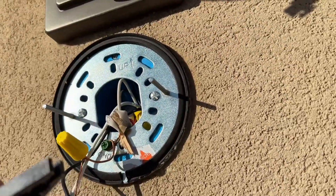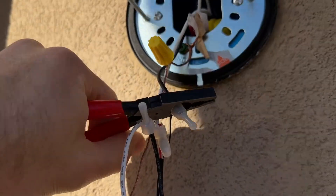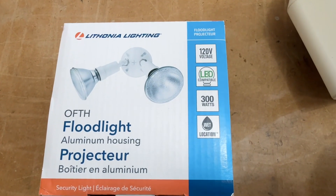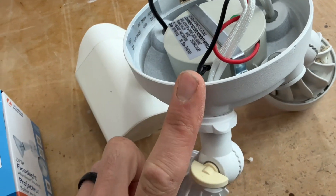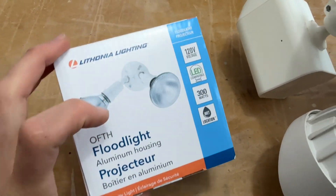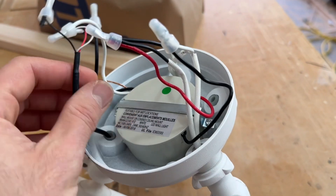Make sure your power is definitely off before you do this. I'm going to clip the side coming from the house because I don't want to lose too much length on the light side. Do that to the rest of them — just clipping out these ties so we can get in there and work with these a little bit better. On another topic, these are the lights I bought at Lowe's. They run about $15 a pair. This is just the sockets — the outlets — and they have a very similar looking base. Before I get too far ahead, I want to make sure that these are going to adapt. I'm going to clip the wires coming out of the lights here and run wires straight through the back of this with some new 15-amp rated wires that go into where we're tying into the wall. Okay, so we got all the wires loose now.